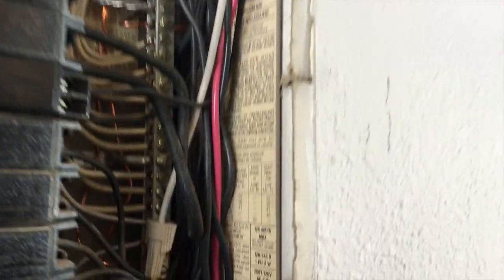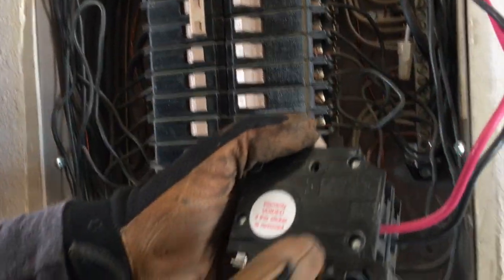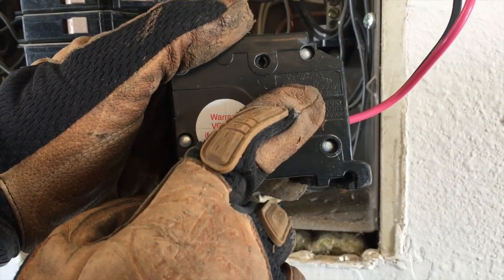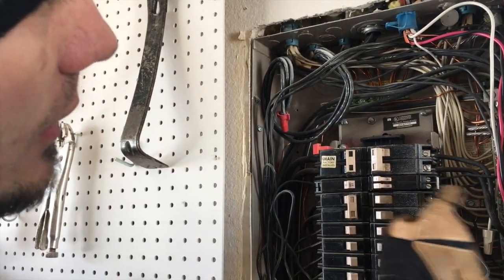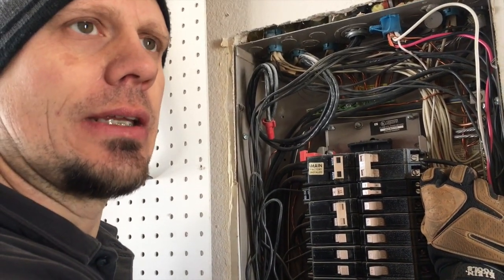I'll go through a couple of code applications for you. Inside this panel, the enclosure states a 10,000 amp current rating for the breakers, and it refers you to the breaker itself. This is a Cutler Hammer CH breaker, and it states the torque specification as well as a 60-degree to 75-degree Celsius rating on the wire. Typically you have to go to your lowest setting of 60 degrees. It's a 25 amp max ampacity on this two-pole breaker, stab type. We did have to run a twin in here to get the AC picked up on its dedicated circuit, which is Article 210.63.